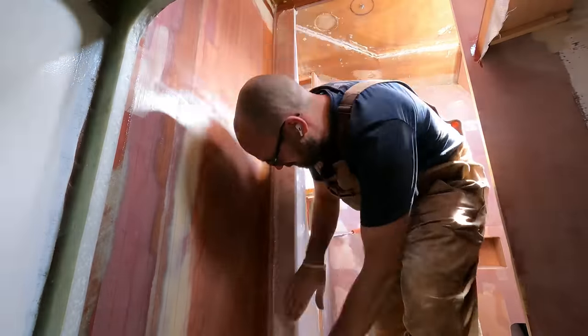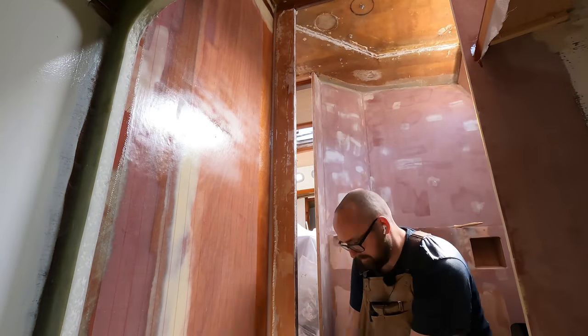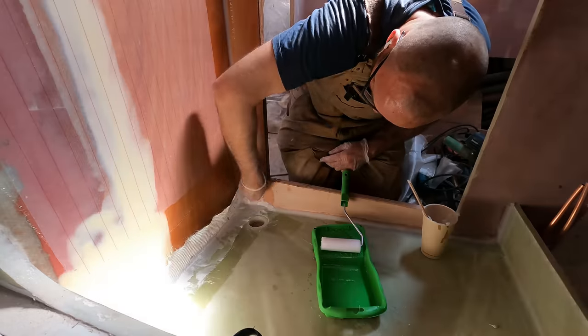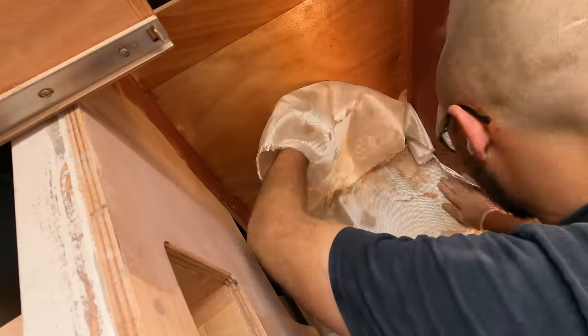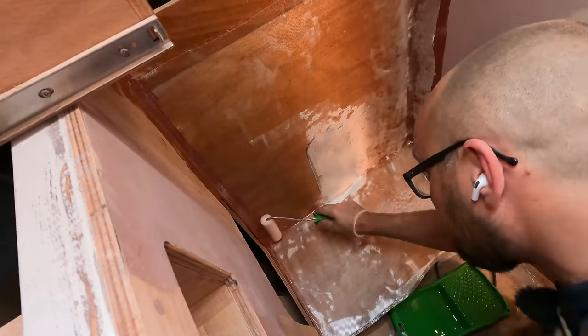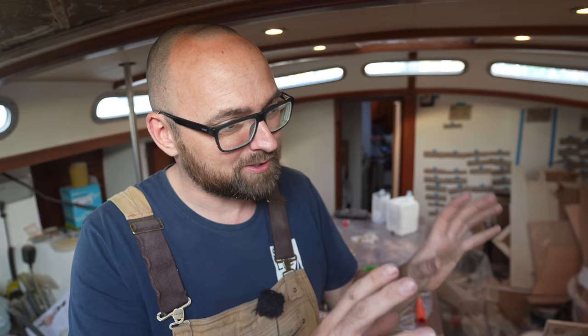I don't foresee much wear and tear around the port lights, which is why I didn't bother laying up glass there. It is a very labor intensive process to lay up glass by hand and once you've done it for a few hundred hours the fun kind of wears off. I made sure to thoroughly seal the edges around the shower pan as well as the holes where I poured in the foaming epoxy. Then it was on to the throne area — the only area outside of the shower where I'm actually laying up glass. It may have looked quick on camera but it took over eight hours to lay up all of the glass and get everything sealed.